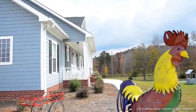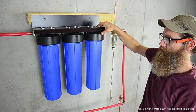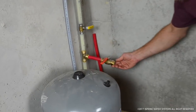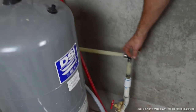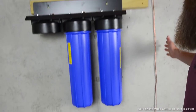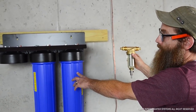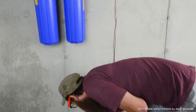My parents' house is in the same situation as ours, so I came to install the exact same water filter in their house today and I hope it can solve their water problems too. I've already started by cutting through the PEX pipe and installing a T, bringing it out to a shutoff valve. I'm going to install a pipe to extend over, then install the spin-down filter, then the main filter system, and then the UV filter over there.